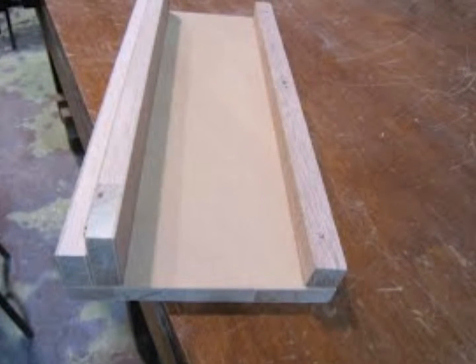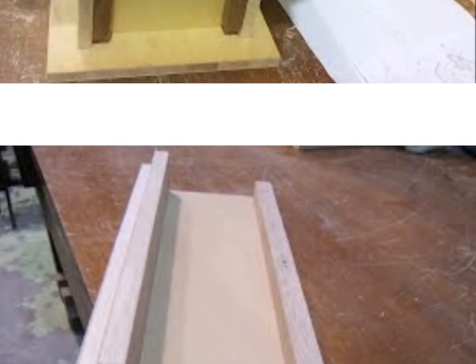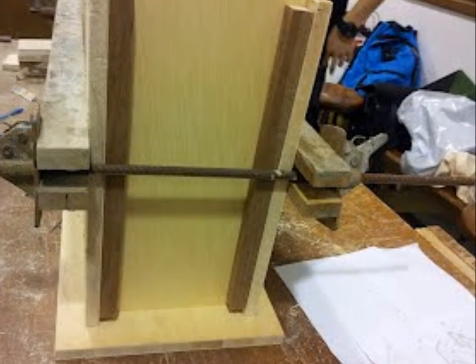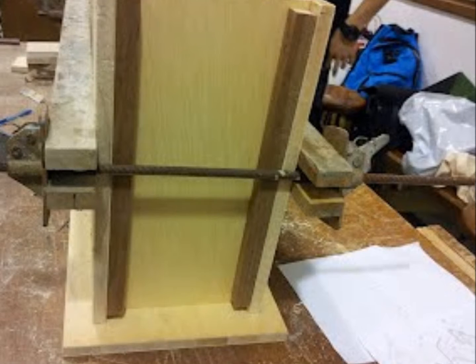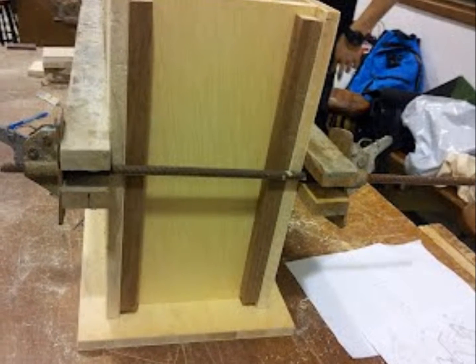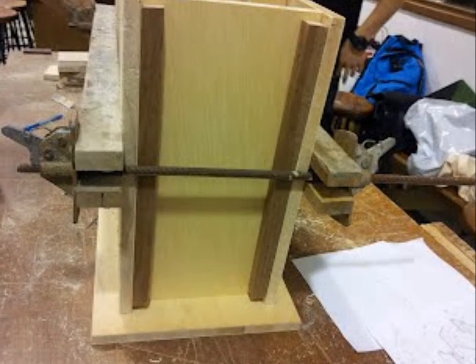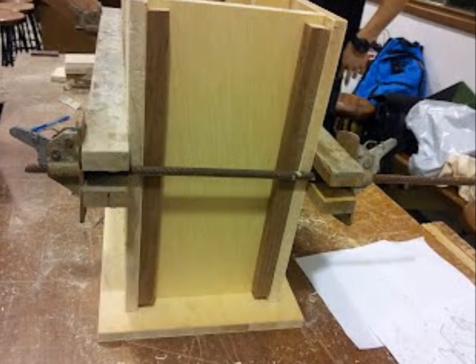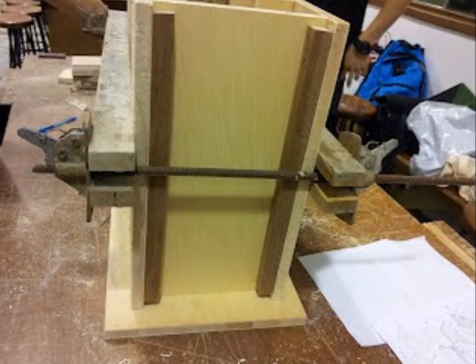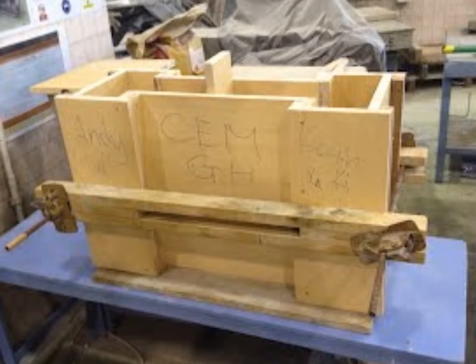Here is one side of our formwork. We try to stand up the plywood to form the I-shaped formwork. When the I-shaped formwork is formed, we use the tie bar to connect the railing. Here is our I-shaped formwork.